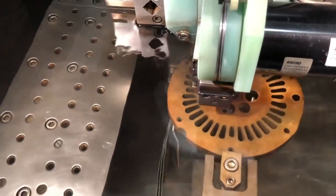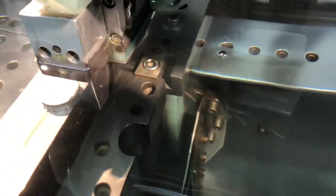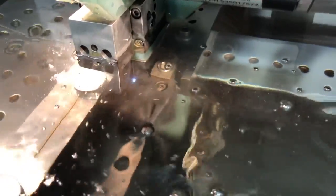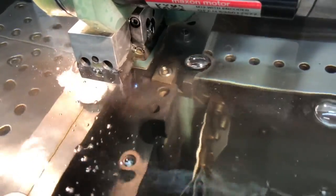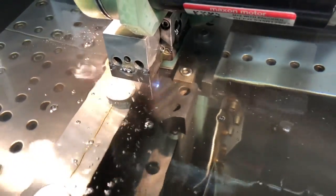That's why in these machines they want to get the part in and out as soon as possible — because of the degrading of the steel and carbide. Low conductivity will actually degrade carbide, which we all know is used in steel drills, saw blades, and everything else. So even though the conductivity is extremely low and the water has been filtered with one to three-micron filters, it's non-drinkable. The turbidity can get very dirty but will clean up to crystal clear with a two-micron filter — yet it's still hazardous waste according to the EPA and must be dumped accordingly. So conductivity doesn't really indicate good water quality.